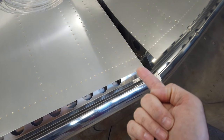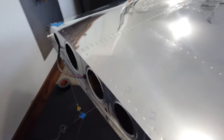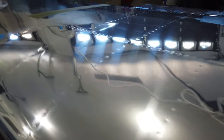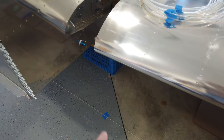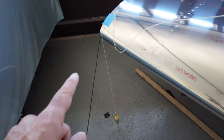Since I made a little adjustment on this wing and drilled and bolted the rear spar on both wings, I decided to re-verify the forward sweep one more time. Like I had done before, I've got a plumb bob at the wing tip. I hung a plumb bob off of the root and made a mark.